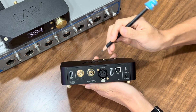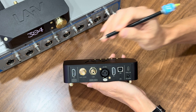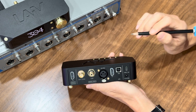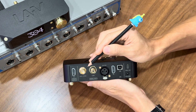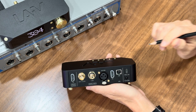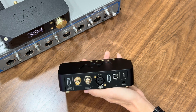These digital input signals are optimized by the complex digital processing inside the Micro DDC and output through an I²S output connector over an HDMI port. Please note this is not a multimedia HDMI — it is an I²S output utilizing the HDMI connector. Additionally, you'll find a BNC master clock input that allows the Micro DDC to synchronize with a high-quality, low phase noise 10MHz master clock, ensuring ultra-precise timing and reduced jitter to the maximum possible.